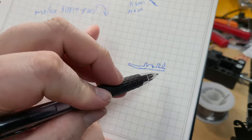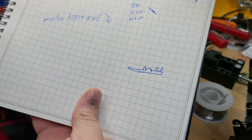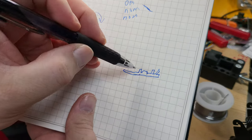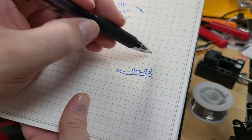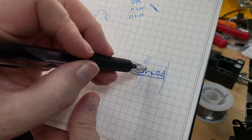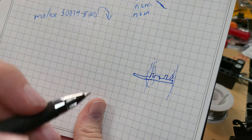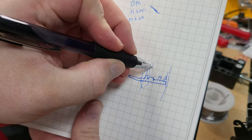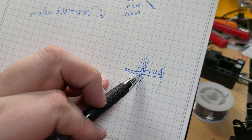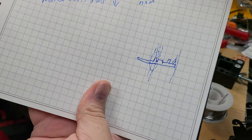Normally with these things, when you put terminals in crimpers, you can put the whole thing inside the crimper and it'll crimp along there. But you can't crimp this tab — it's got to stay — so you have to be very careful to make sure that this tab is sticking out of the crimper.